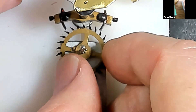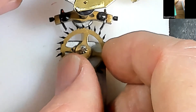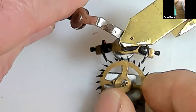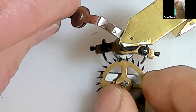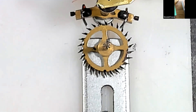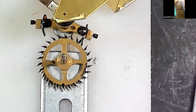You can see the kick — when I turn the escape wheel tooth across that impulse angle, you can see the little push. The same thing on the exit: you can see the escapement moving, and that's the kick that goes down the crutch and moves the pendulum. So that's those three kinds — let's go on to the next one.